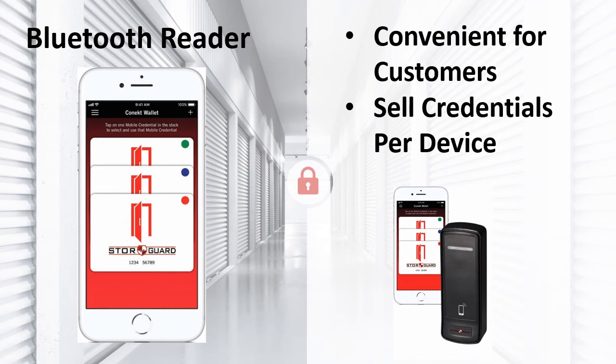This is the day of the smartphone — customers want to use their phone to access the facility. StoreGuard offers this with the Bluetooth reader and app. The end user downloads a free app, then enters a credential purchased from the self-storage facility. The facility enters the same credential into their access control system. The end user is then able to drive up to within five feet of the receiver — typically mounted on the side of the keypad — and push a button on their phone to enter. Please note that the credential is only good for one device; if the customer gets a new cell phone, they will have to purchase a new credential as it is not transferable.